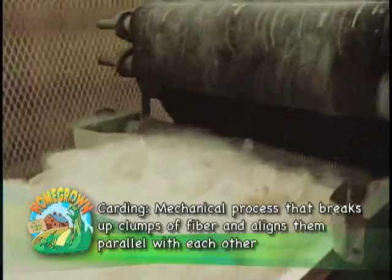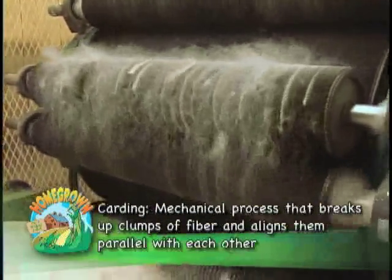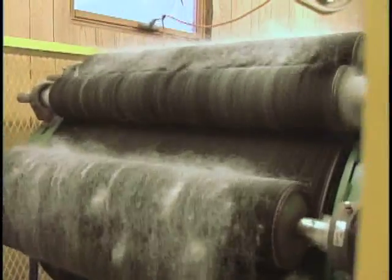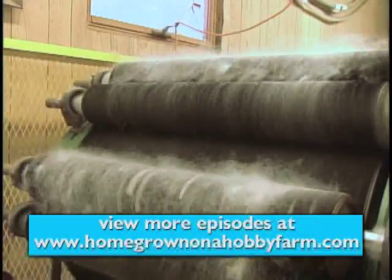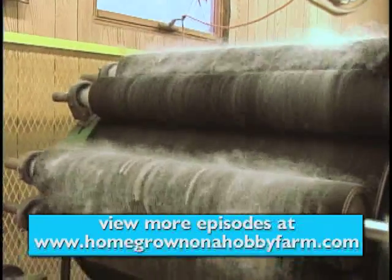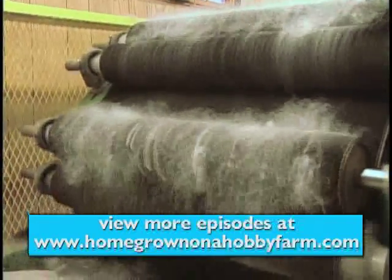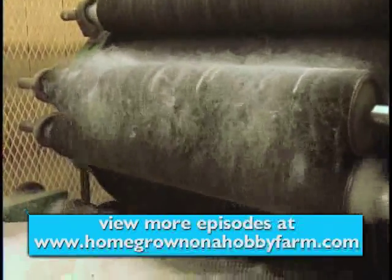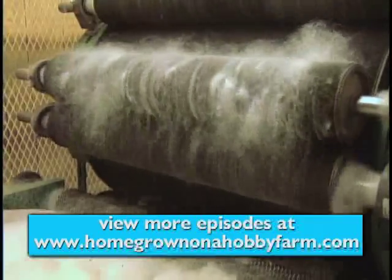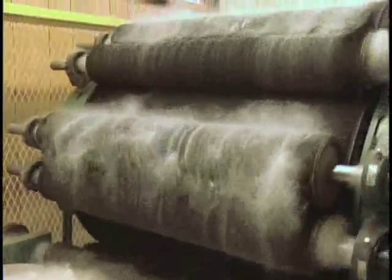As the fiber feeds in on the feed belt, it gets put onto the main drum, and then the two small rollers that are next to each other, they're workers and strippers. One takes it off of the main drum and puts it onto the other one, and it puts it back on the drum. And each time it's starting to align the fibers more parallel with each other, as well as fluffing the fibers up even more than the picker did. This will really open up anything that's left after the picker,